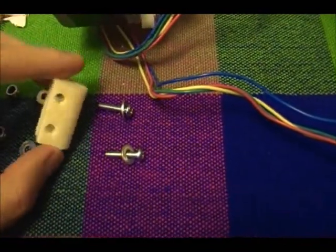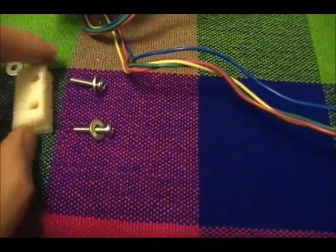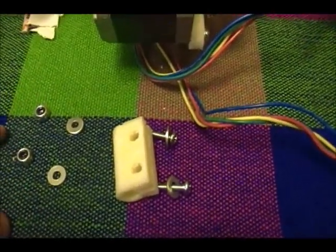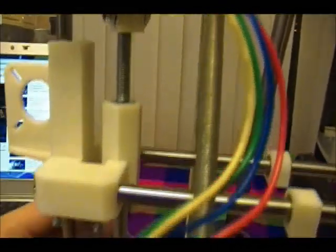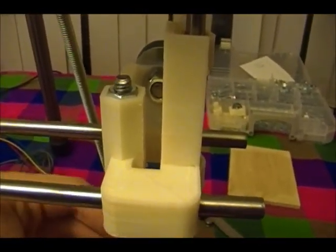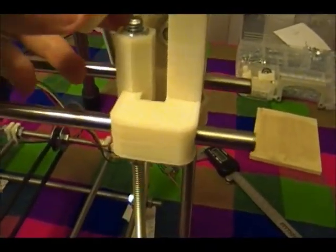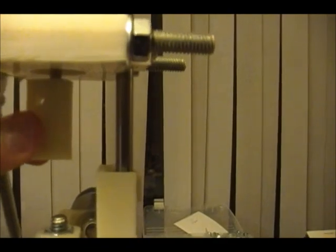So this is one of the couplings — that's what I'm going to be installing next. I have three-quarter inch number 6 screws with a washer and a coupling and then another washer and a lock nut. That will be going right there, and I'll be installing that next. I've already installed this side. All it is is a nut underneath, and then inside I put the spring on top of another nut and then we're going to thread this up. Then we're going to put this assembled coupling here, screw that in until it gets to the middle, and then screw it up into the motor as far as it goes and then screw it on as tightly as possible without breaking it.